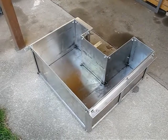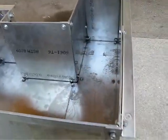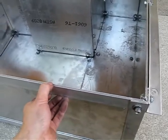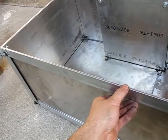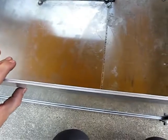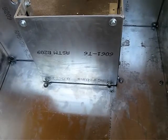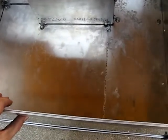Just to finish up on the battery box topic: all of the structural members are based on those angle pieces. Then we've got some straight flat pieces that connect things together to give it a little extra support — not necessarily load-bearing, but they help stiffen things up. Then we've got the sidewalls of the box, which are a really hardy aluminum — 6061-T6, which is a construction-grade aluminum, very strong. I think it's 1/16th of an inch as opposed to the ⅛ inch of the angle pieces.